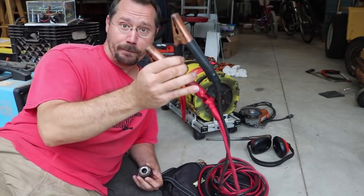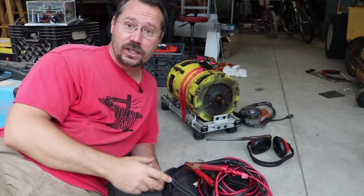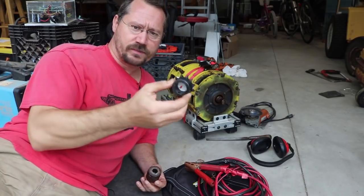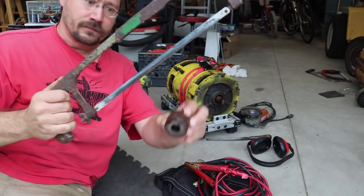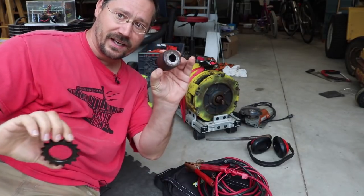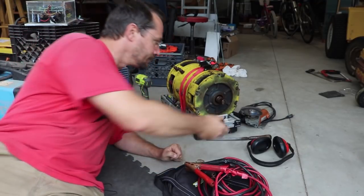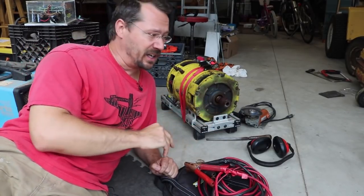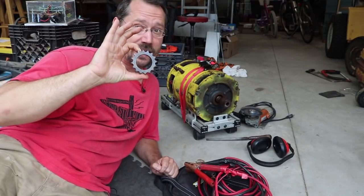What I do have going for me is jumper cables, a hacksaw, and an angle grinder with a cutoff disc. I was originally trying to figure out how to attach some sort of a small sprocket with a hub like this. I think what I'm going to do is use the hacksaw to cut off the extra material. I found a sprocket which is not much smaller on the inside than the hub, so I'm hoping I can turn this down by putting the whole thing on the electric motor, spinning it up, and using the angle grinder and emery cloth to get it to just the right size so we can put the sprocket on. Let's give it a shot.